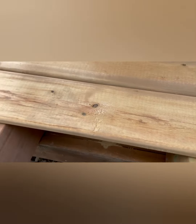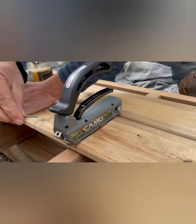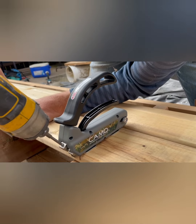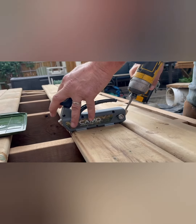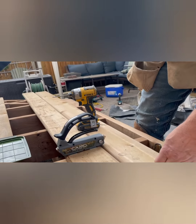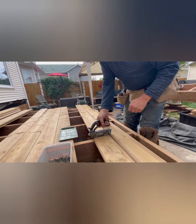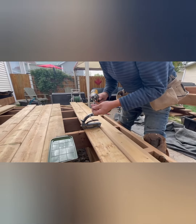Nice handy little latch there just to trap it through boards. These are five and a half inch, and it also works down to four and three quarters — check another video too if you need to. I find with wood as you're putting it together your gap is going to have a little bit of variation, and even the size of your board. So every five or six boards you want to have a little correction line just to make sure that everything's working out for the end, so you don't have some kind of funny wonky board once you get to the house.